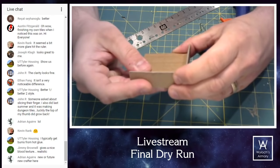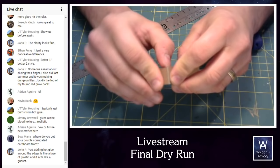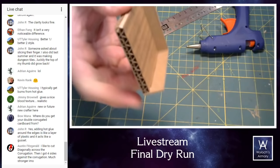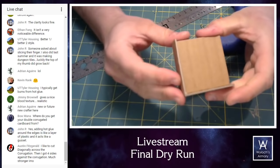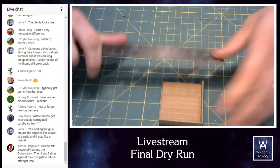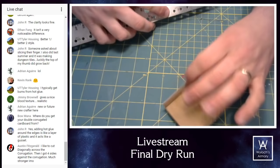Okay. Just hold that so it cools right. And then you can see what I did at the corner. And so here, see there's a tiny bit of overhang on this? So all I do is chop that off. Actually, when I cut these, I've gotten to the point where it's all memorized and I can just cut them to the right length, but for simplicity, just to illustrate it, that's why I did it. So now we should be able to take our ruler and see with the new thickness of the wall, we have an overall width of 2.5. And we do. Good.